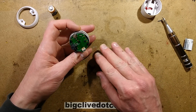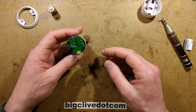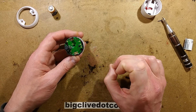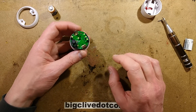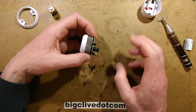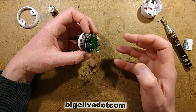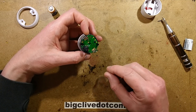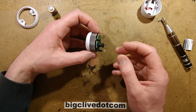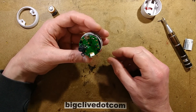When it takes a sample, if it detects a sudden change in reflectivity since the last sample, it steps up the sampling rate and starts doing several tests in quick succession. If it detects that a particle of dust caused a reflection and then it's gone back to normal, it switches back into standby mode — one test every ten seconds. But if it detects an ongoing level of haze in the air, it takes several tests to confirm it's a valid alarm condition, and then it starts making the sounder go.